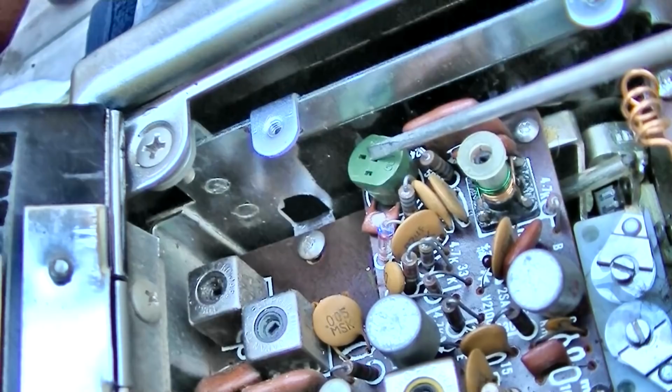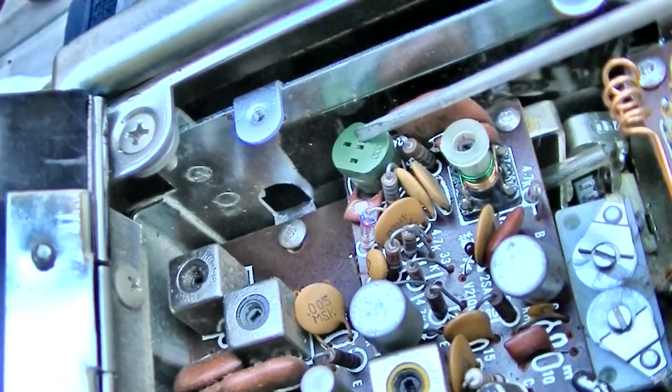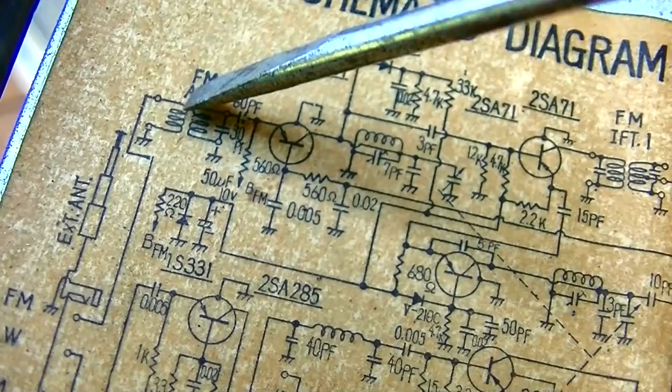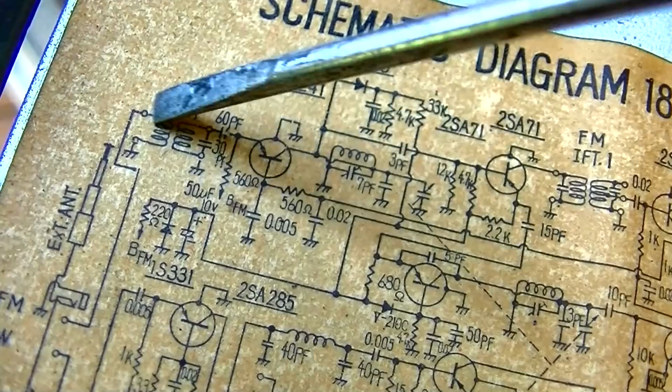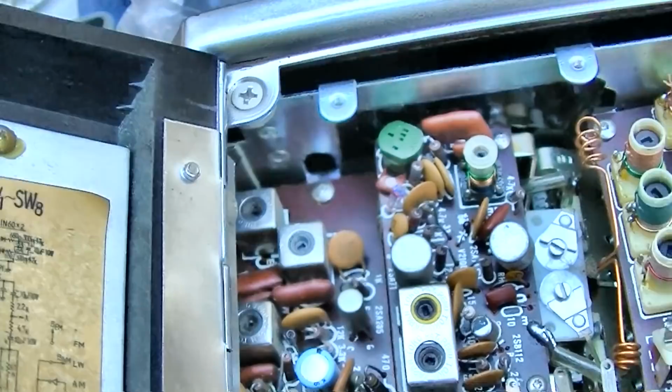We've talked before about this transistor getting easily whacked when somebody with a static electricity charge on their hands touches the antenna and it whacks the transistor. I'm not quite sure how that works, because you would think that this transformer right here would isolate any kind of DC static charge and drain it off to the chassis of the radio. I don't know how it would get through here, but maybe if you had a 50,000-watt CB amplifier, it would cremate this transistor. But anyway, that's an issue. And yeah, we should have some activity, so I don't know, there's something else going on.